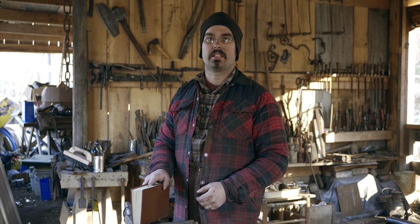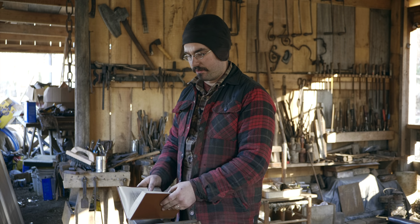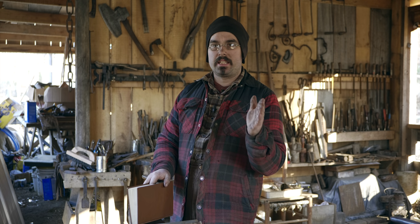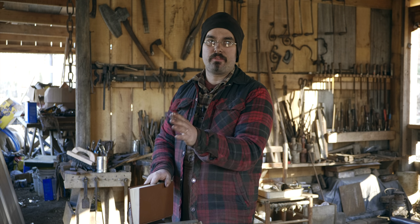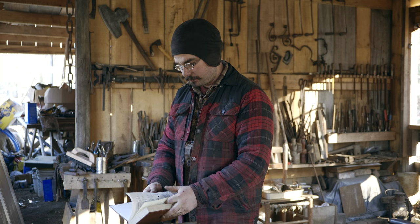That would be the U.S. industry standard label for that steel, 1075. So anything between 1075 and 1085 is gonna match what he's calling for pretty well.